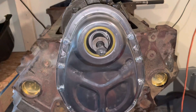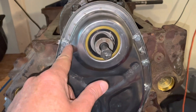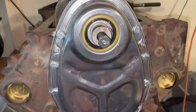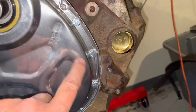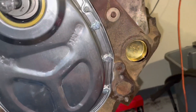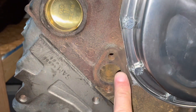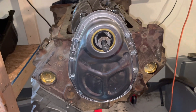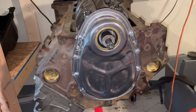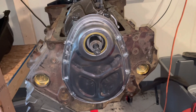The timing cover is now on with all bolts tightened down. Another drawback to this timing cover is I couldn't get a socket in to tighten some bolts — I had to tighten them manually with an open-end wrench. I'm also concerned about the water pump body potentially hitting the edge of this cover, especially in one area, so I may need to address that. The timing cover is now on and that wraps up this long video about installing the timing cover on a 5.7 MerCruiser engine when you're swapping from a newer model 5.0 to an older model 5.7 block — these are the kinds of things you'll run into. Thanks for watching and subscribe to my channel if you find this beneficial.